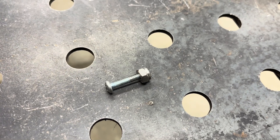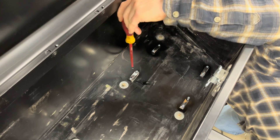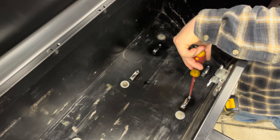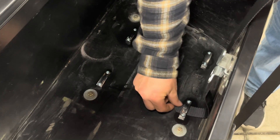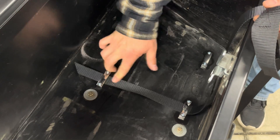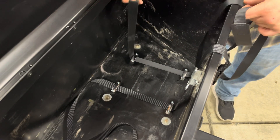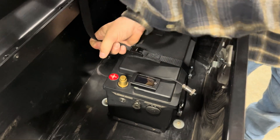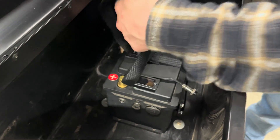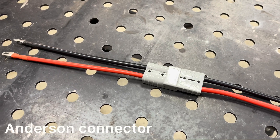The kit does come with screws but I tend to stay away from those on this trailer build where things will be vibrating and could come loose. I decided to use 10-32 by one-inch machine screws with nylock nuts underneath so they're fast and secure. Once the brackets are bolted down, we feed the straps through and position the battery. The tie-down kit was inexpensive, simple to install, and utilizes cinched-down buckles to secure the battery nicely inside the box.